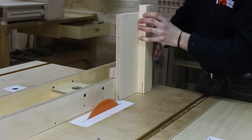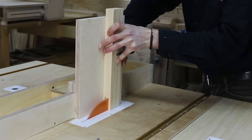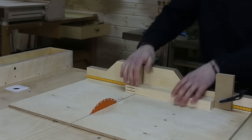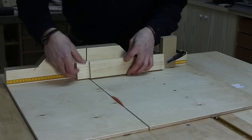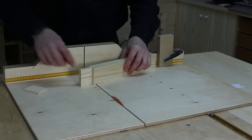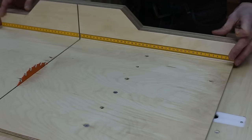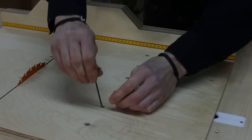With the bigger disc I can place in my circular saw, 235 mm, I get a max cutting height of 70 mm. The incremental channel has little adjustment bolts to reduce tilt. You can even block it if you need to.